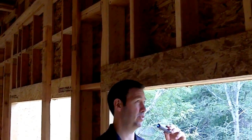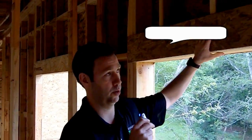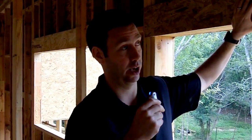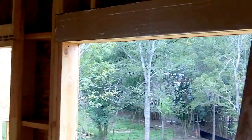And when that's all put together, it's just so nice, and it's a good thermal break. Basically, I believe that 3/4 foam is R4 for a 3/4-inch of foam. So now I've got an R8 insulated header, which makes a big difference. On these wall cavities, 2x6 walls, that's an R19 wall. We're also using 3/4-inch foam on the outside of this house. So now we've really got a good insulated header. We're reducing the thermal bridging in this house, and of course it's strong and is really reducing our drywall cracks in the future.